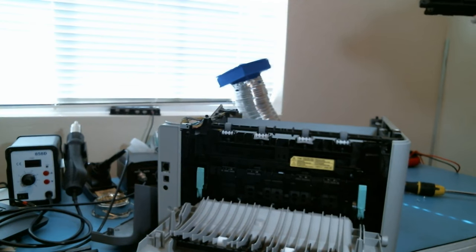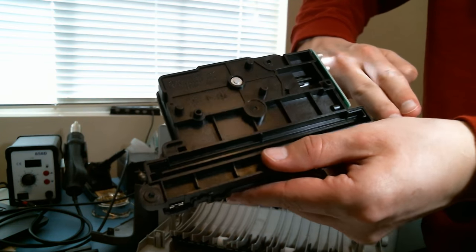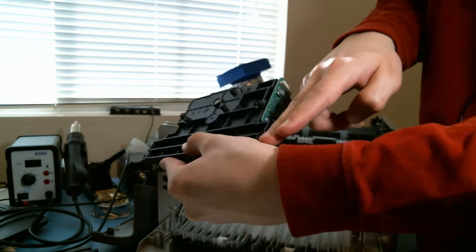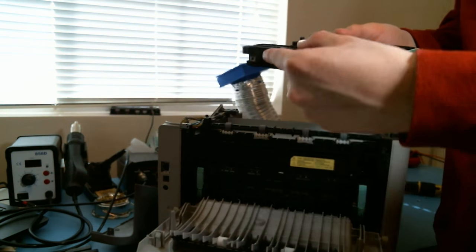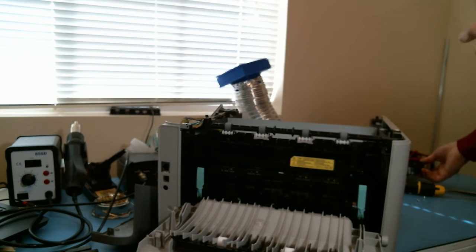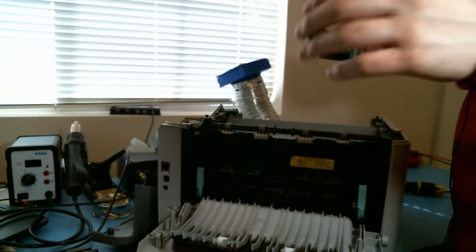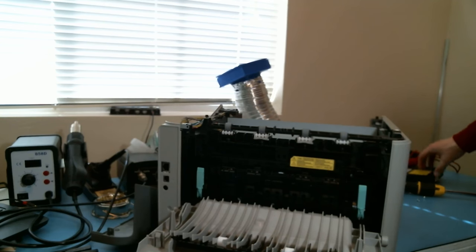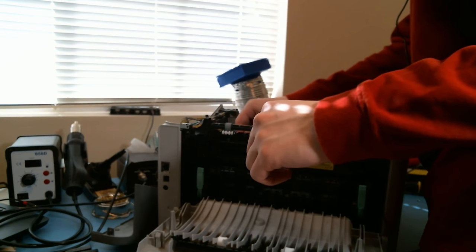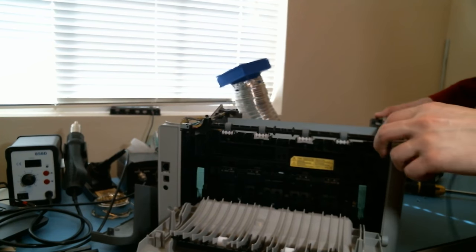Maybe there's a mirror? Oh, yeah, there's a mirror in there. I see. So there's a 45-degree mirror in here. So the laser beam's being directed at an angle, reflects off there, comes out. And that's how it's shining on that larger green photosensitive. I don't even know. Is that an ink? A dye? Whatever that is. See a couple gears. I think that means we're getting close to the steppers.